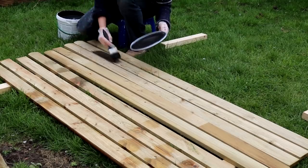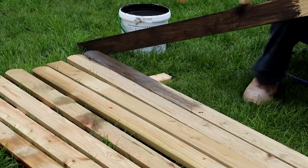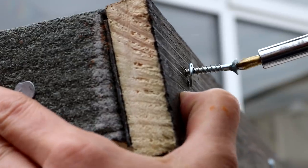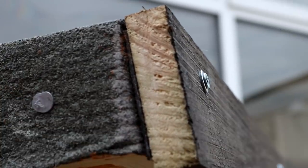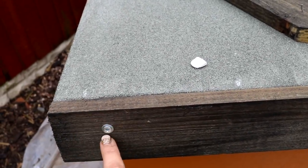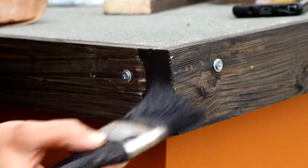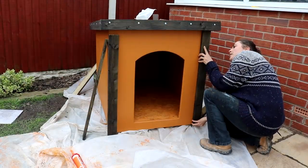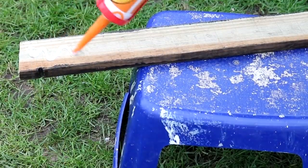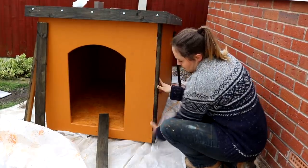It's always exciting when you get to the last part — staining the trim. After cutting them down to size I drilled holes and screwed them into place with screws and a washer for detail. Before fixing them in place, it's a good idea to mark where the clout nails lie so they don't get in the way. I re-coated any new cuts I made. For the final job I cut pieces of trim to cover any end grain and any screws, applied construction adhesive, held them into place, and attached with screws and washers to match.